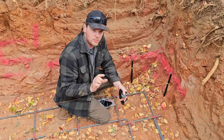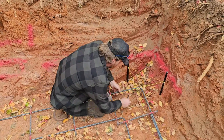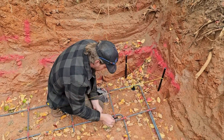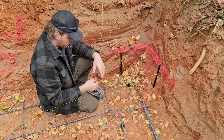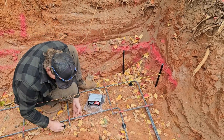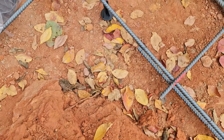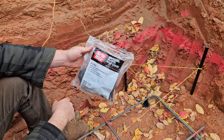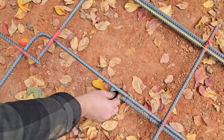The height of a brick is going to be about the right height. But if you don't have an old brick laying around — the ones we tore out don't have holes in the middle so they don't break real good — instead you can use these chairs that are actually designed and made for the rebar. They just come in a bag, you can get them at Home Depot, and they're two and a quarter inches tall, which is about the height you want.